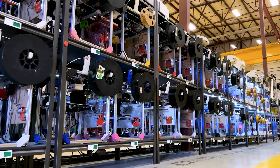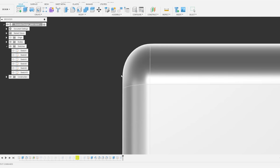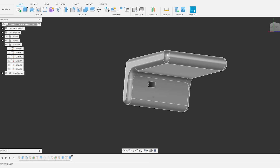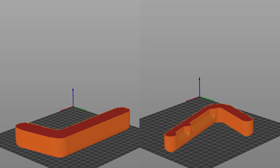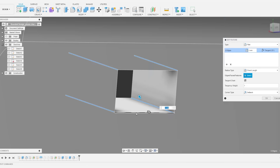Throughout all of this, I was constantly thinking about manufacturability. When you're designing a product, anybody can create a single design and force it to exist — but if you want to make a lot of them, manufacturability is really important. I work at a large print farm printing parts for other people. The biggest problems I was concerned about were the outer edges — fillets are always bad against the print bed because you get infinite overhang. I designed a version to see if I could get away with it or deal with the proportions, though I'm pretty sure it will fail. Prototypes always reveal things that go wrong, so you put as many tests into the first print as you can, then take that information and refine.